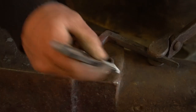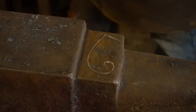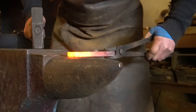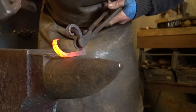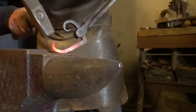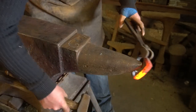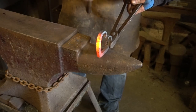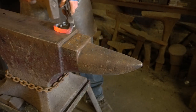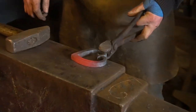I'm just going to quickly draw around this so I can compare the other side — that's where things get awkward, you've already got a scroll in the way. Over the bick this time because I need that space. Let's scroll it up to match. Compare that shape — about there, maybe a little bit tighter. We need some more bend lower down on this one, which gets really awkward because that other scroll is in the way. There we go, it's starting to bend where I need it to.